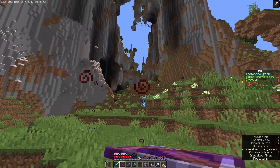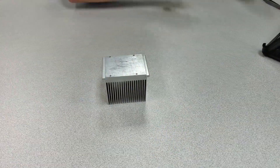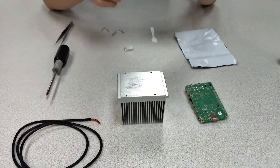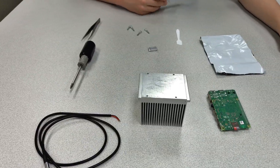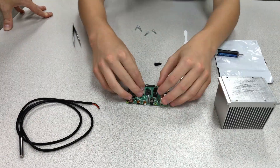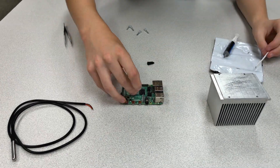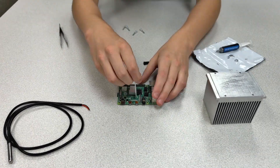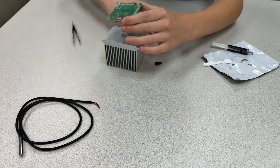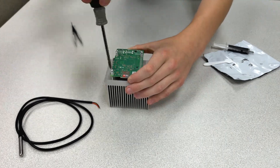So I was confident I could cool this with just the heat sink — no fans required. I've never used thermal components before, so it was a fun new learning experience. I put some thermal paste onto the CPU of the Raspberry Pi, then built up the standoffs and put on the heat sink, applying thermal paste between each junction. Then I panicked thinking the thermal paste was going to fall off and quickly threaded the screws to attach the Pi to the heat sink.